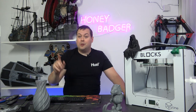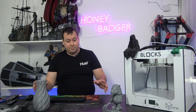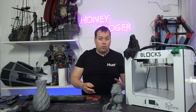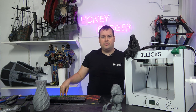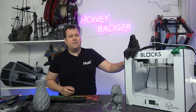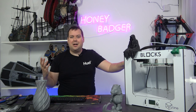That is a very, very strong competitor to start taking shots at. This machine does do some gorgeous prints — really nice quality, consistent extrusion. The support settings that came on it were pretty good. A weird quirk I found was that in Cura version 4.12 there is a stock profile for the Blox machine, but in the new version of Cura 5 there isn't — it's been taken out. I don't know why.